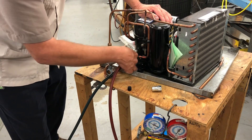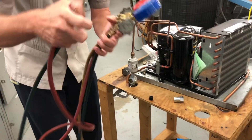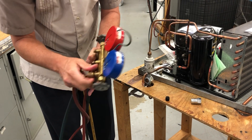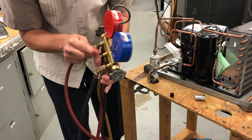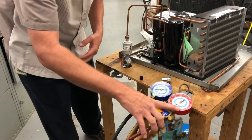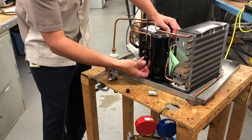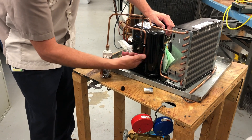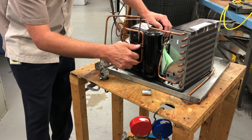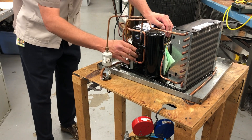We're going to lose a little bit still, but no liquid came out — just de minimis, a little bit of vapor. Remember, always cap the hoses. So if we're not being used anymore, we're going to cap the hose here, cap the hose here, and we can pull the other hose off the tank and cap that as well when we're ready. The tank was shut off — we didn't have the tank on from before, so that was always been off. And then don't forget, you've got to put the caps on everything. We don't leave the caps off because the valve could still be leaking. Even though it's backseated all the way, it might have some dirt in that seat and it's not letting it seal all the way. So just as an extra measure.